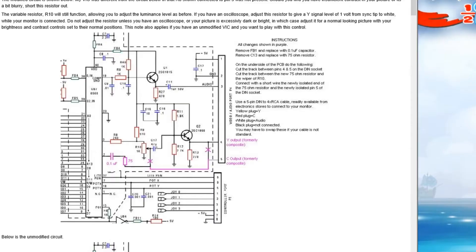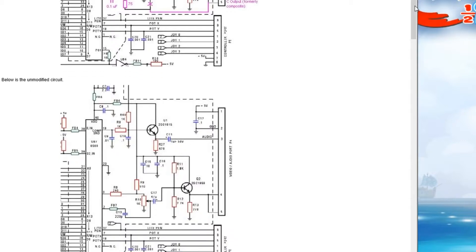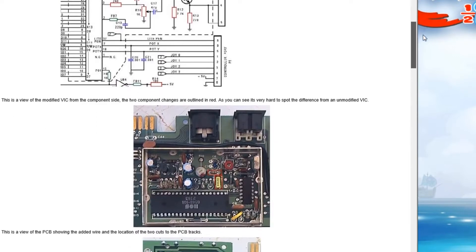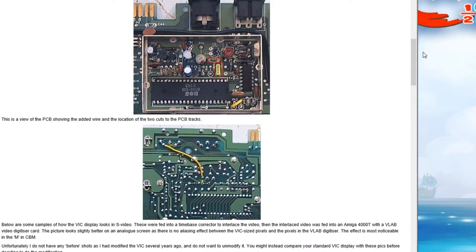I will show you exactly what we are going to be doing to do this modification. There are already some instructions online on how to apply this S-Video mod. This one from sleepingelephant.com shows one for a common motherboard revision called a Revision N. My motherboard is a different revision but the same basic principle applies. From the factory the Chroma and Luma signals that would normally make up the S-Video signal are connected together instead of being apart. Now we are going to sever that connection with this modification.